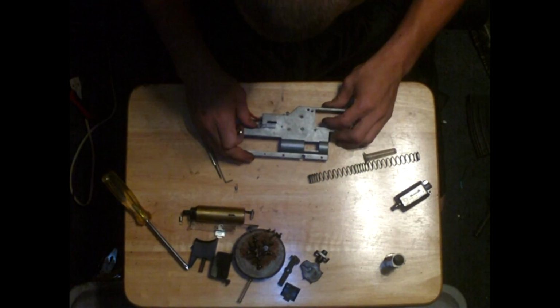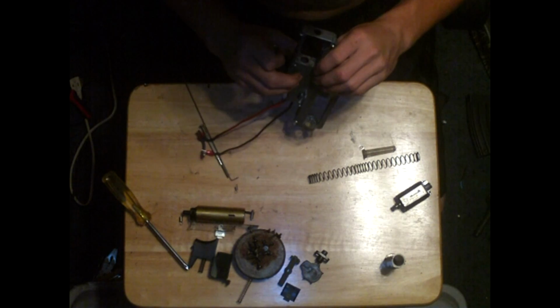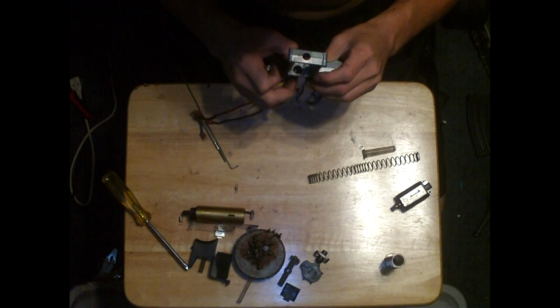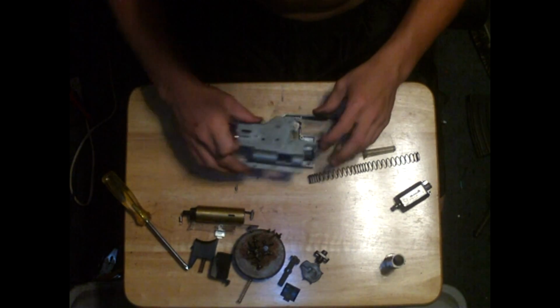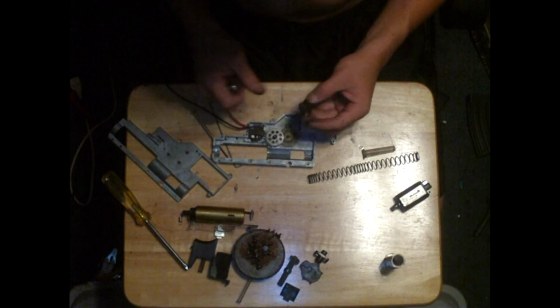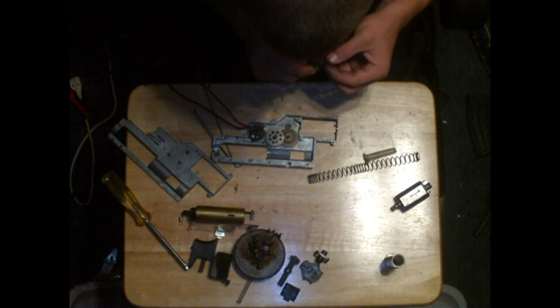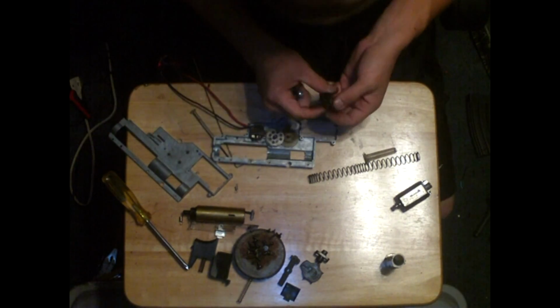Same exact thing here. Put it in, close it up, nothing else, no shims, no nothing. For the FN, it's a little hard to get in there, so it's sticking out on both sides, and that's how I figured out how much it moves. And this is moving from both sides, so I'm going to put a shim on the bottom to start with. I'm using a wide 0.1.